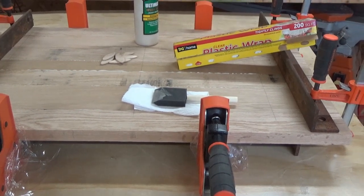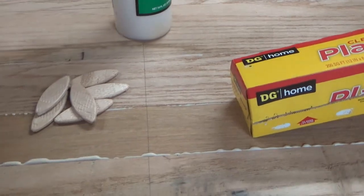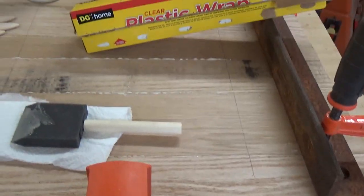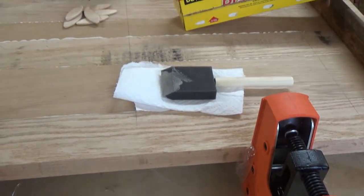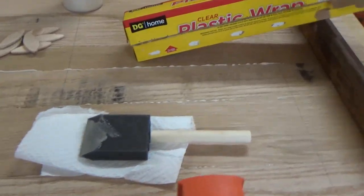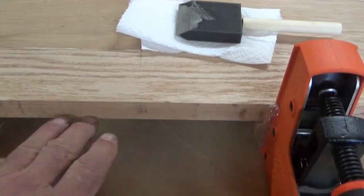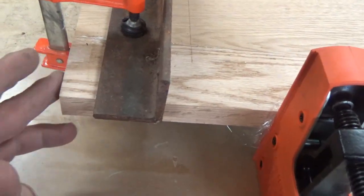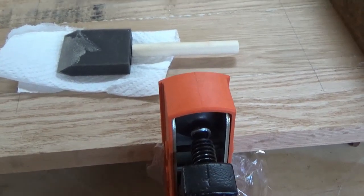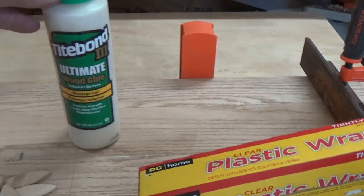I made this out of a bunch of oak pieces — one, two, three, four, five, six, seven pieces to get the width. I cut each piece of oak to 32 inches. It's going to be a little bit bigger than 32 because I'm going to put some trim around the perimeter, so it'll probably wind up being about 33 by 25. I've already forewarned them.